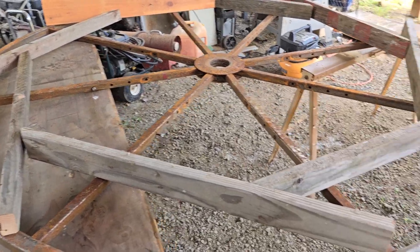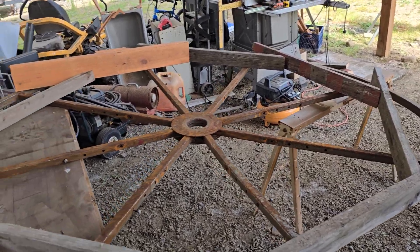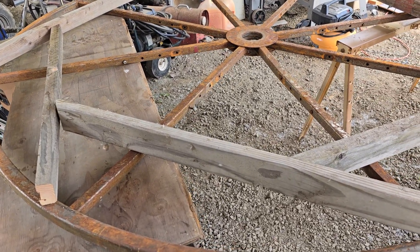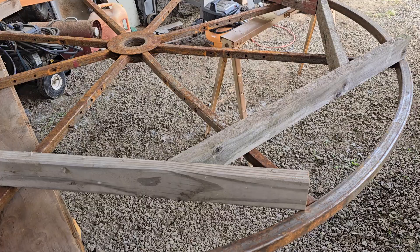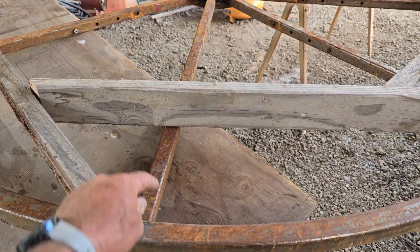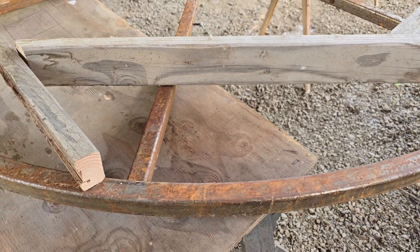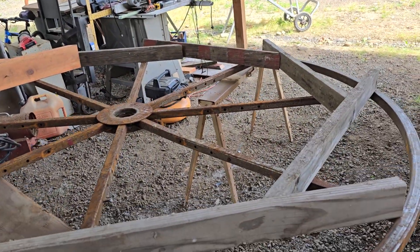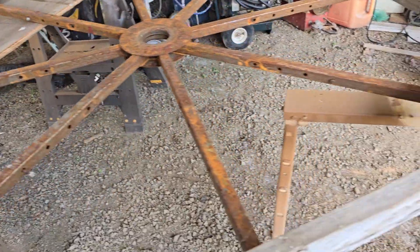These will eventually be made out of probably two-by-12 PT. These are 42 inches — I would probably make them 44 inches with a 45-degree angle at that end. How I finally figured out the best way to do this is just put a gap right here on this rail of nine inches, and that's how I based it out.